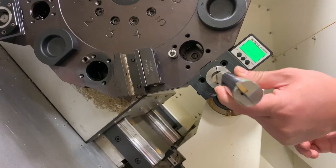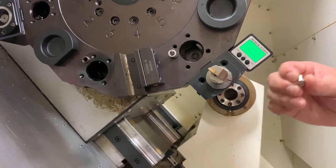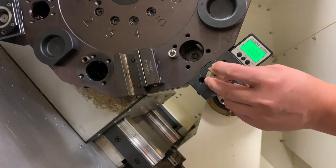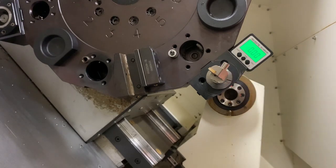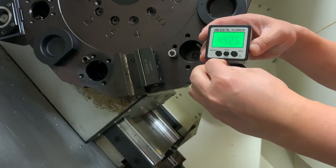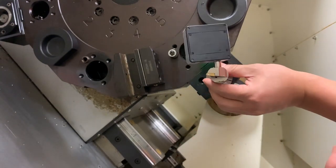The first step is to find the zero reference, and the second step is to put the tool into the fixture you want to clamp. We have also included a small magnet in the same package as the protractor. The magnet has a quite unique advantage because it makes it much easier to hold the protractor on such a small surface area of the cutter head. Now I'm going to move the protractor onto the magnet. You can see that with the magnet, we can rotate the protractor in any angle we like and it will still stay in position.